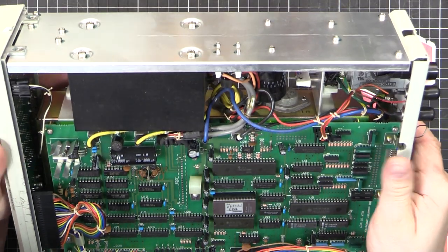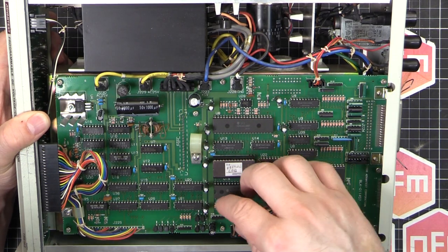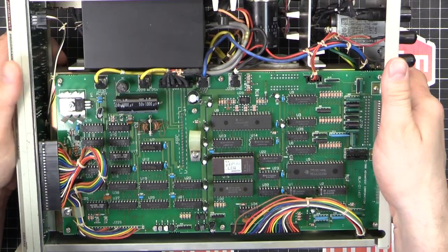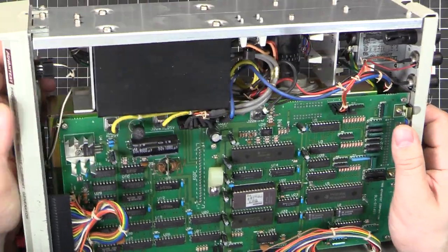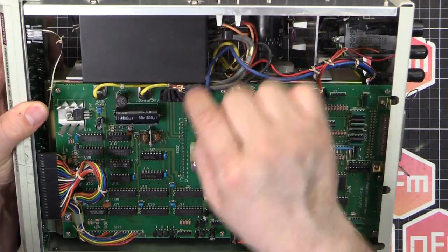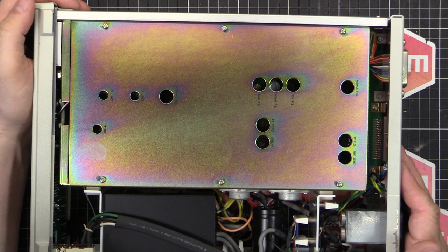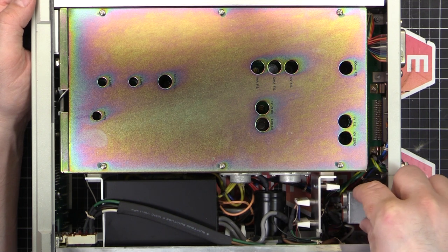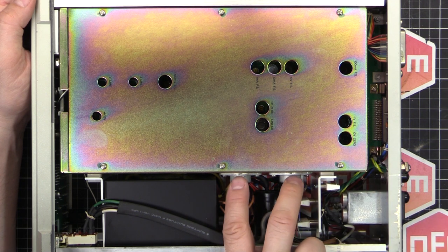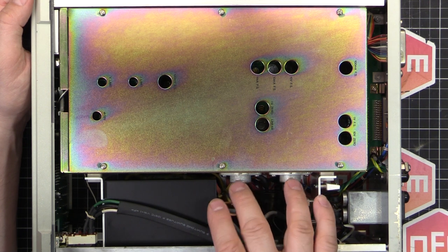So that's basically the top - front panel controls, EEPROM for the firmware, the logic, the controller, microprocessor. And this big black thing is the main transformer - it's just got an Advantest part number on there, a black box with wires coming out. On the other side is where all the good stuff happens. You can see the transformer and the line input filter, and the ceramic standoffs. Over here we've got two pass transistors - that's what would be doing the actual output.